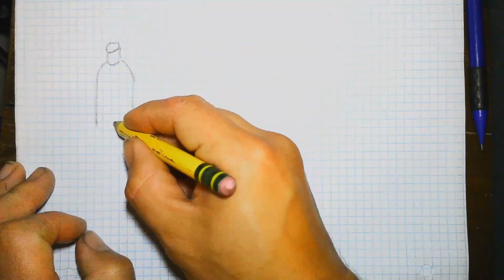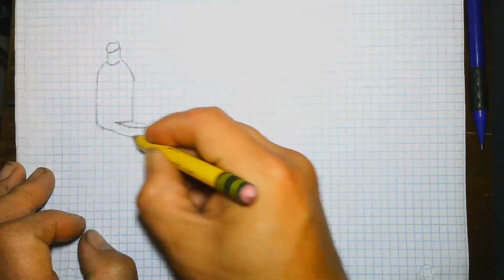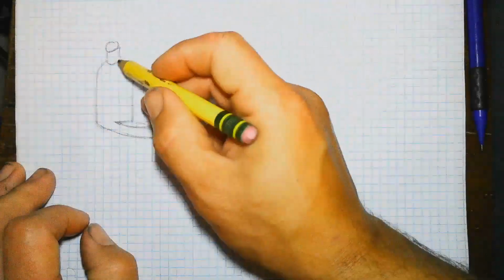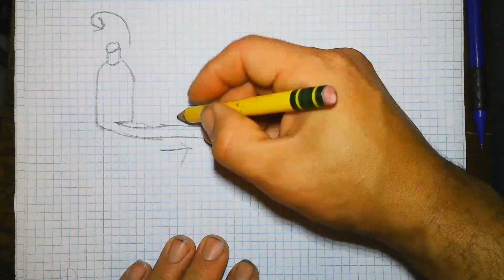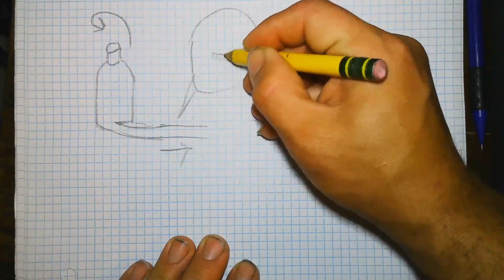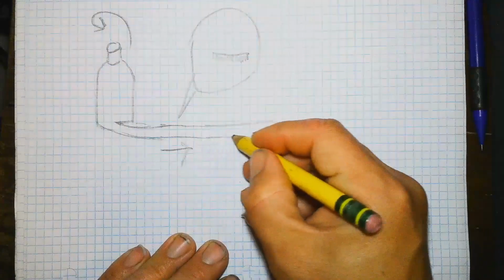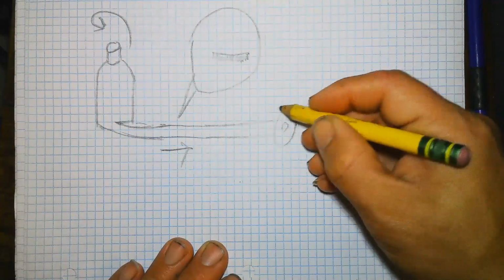There is, however, a process for recycled plastic filament which has made the rounds in the DIY community, which is simultaneously a more jerry-rigged looking solution, but it's also more often praised for printing well. The process involves using a jig to cut the cylindrical portion out of a soda bottle into thin strips, which are subsequently rolled into a tubular shape and then spooled like regular filament. The process is extremely labor intensive.